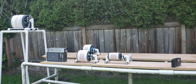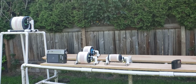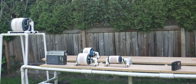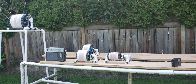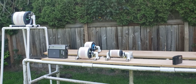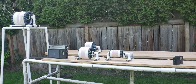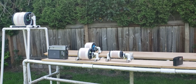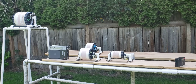The first thing you need to know is because of the razor-sharp FSL tuning, you need to be very careful and patient in finding the perfect signal-boosting peak. There are some steps that will assist you in doing this. As you can see, I've got four FSLs set up and a couple of portables on this table. No matter what type of FSL you have — whether it's a ferrite bar model, a ferrite rod model, a monster FSL, whatever — the principles are all the same. So it's best to practice these, get used to them, and when they become second nature, that's when you can go out to your favorite ocean beach and really run wild.